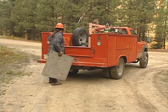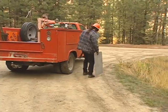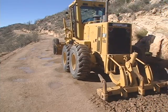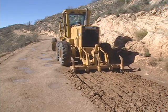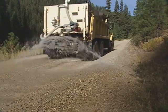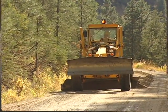As in any road work, before reshaping a road, place your traffic control devices and safety signs. In addition to watering, you may need to scarify the traveled way. Scarification and adequate moisture content will facilitate cutting, control of dust, and compaction. Details of the scarification and watering process may vary from region to region, but the actual reshaping procedure remains the same no matter where you are.